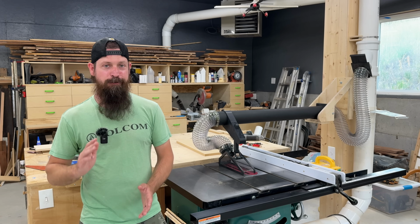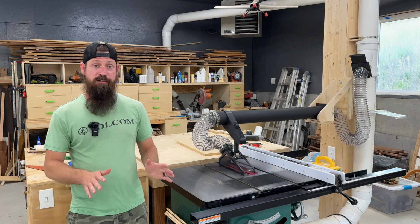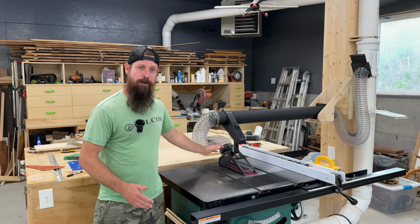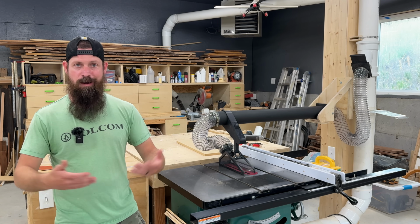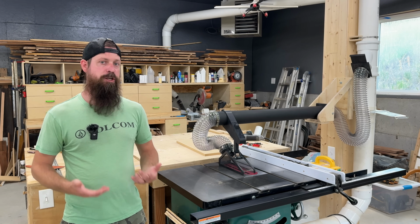Alright, so really quick, I got lost in my notes when I was doing my voiceover and I misspoke with those 2 values. The ones I displayed were the accurate figures. And the reason why I did that is because obviously if I take my reads right at that 4-inch hood, I'm going to have the highest airspeeds and the best CFM flow. But I was curious to see what that air did once it got inside the hood. So I took those 2 additional reads to kind of give a more accurate representation of what's going on.